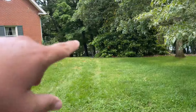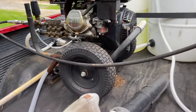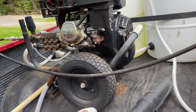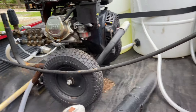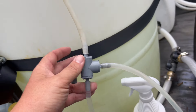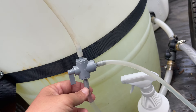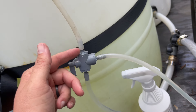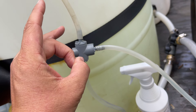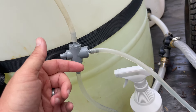There's a little building down there where I did concrete — they didn't have a water hookup. I was able to take my tank down there, pull from it, and go at it. My machine's four gallon — yes, I'd love to have an eight gallon. I got this little three-way ball valve: one side pulls bleach for the downstream injector, this side pulls from my buffer tank for water. That allows me to rinse my injector when I'm done, which is great. But I like using the soap tips on my J-rod for volume when I'm rinsing, so I can flip it that way and have water coming through. Works great.